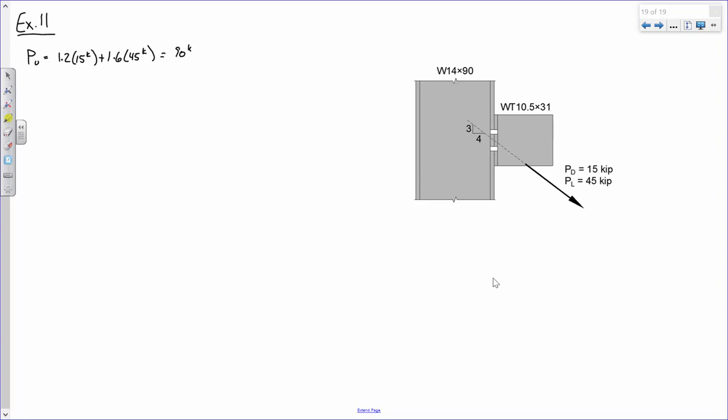Now, I've got this load on a 3-4 slope ratio. So, help me out. Based on this connection, which is going to be the bigger component, the horizontal component or the vertical component? The horizontal. It's going more this way than it is down. Now, the horizontal component, is that going to be tension or shear? Yank it on the connection, that's in tension.